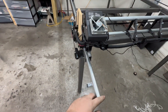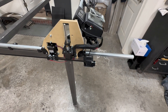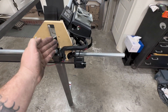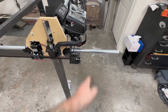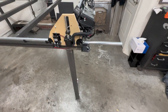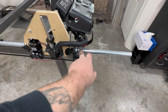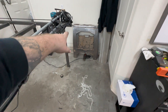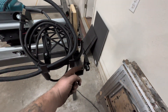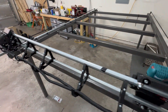I still need to cut this piece of conduit off — I'll probably leave just a little bit because the machine goes all the way back and that last wheel comes out right to this edge. I want to leave a safety piece so it doesn't fall off, put a cap on the other end, and maybe put a little lip on this so the wheel can't fall off. It only has limit switches at that one end on either side anyway.